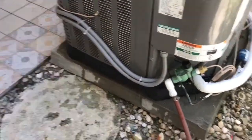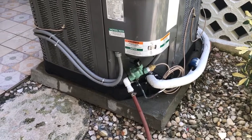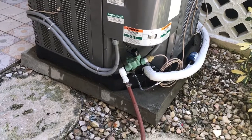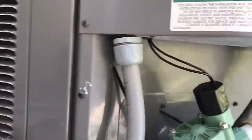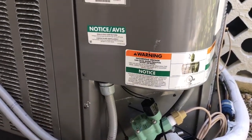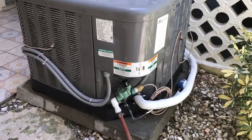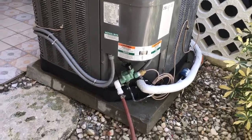I did it differently. I hooked up my hose to a standard 24-volt sprinkler valve — that's 24 volts AC, which is the exact same voltage the air conditioning system works on. I put that valve in there; there was already a hole into the electrical box, so I wired the wires up into the box and connected them to the two wires for the positive and negative on the 24-volt system. When the compressor kicks on, this triggers the water sprinkler valve to turn on and run the misters.